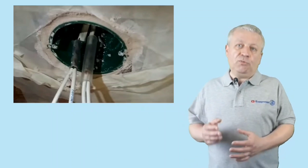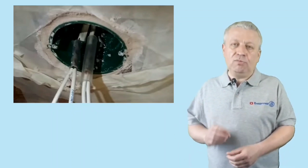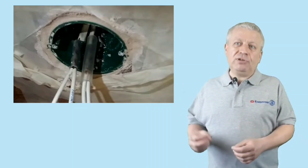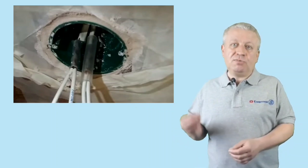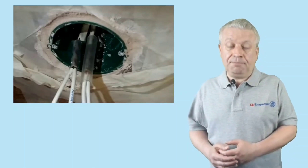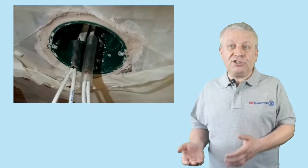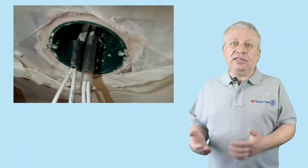The bundle of wires needs to be laid into the socket niche with great care, since aluminum does not like sharp bends. Since the added copper cores are flexible, at the end of these conductors put on insulated tips — only after that they can be safely wound into the terminal blocks of sockets and the screws tightened. This is not the only way to extend aluminum wires, but it is one of the simplest — as opposed to welding or soldering — and reliable, as opposed to twisting.